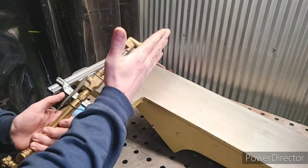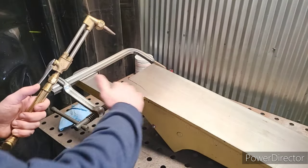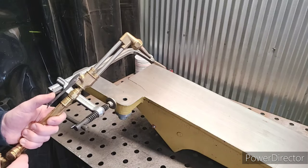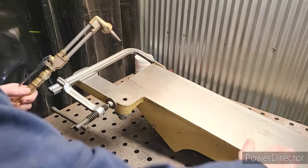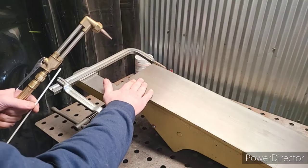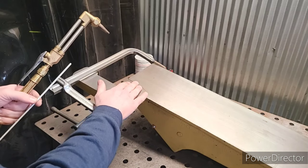For preheating this, I'm going to opt to use the cutting torch head. We don't really need to use the welding torch head — it's a little bit too small for this big part. The settings I'm going to have on my torch are about 6 psi for the acetylene and about 20 psi for the oxygen. I'm going to go ahead and preheat this entire part. Once this entire part is warm to the point where I can just keep my hand on it, then we are going to start heating this area. We don't want to heat this to the point where we are bringing the material to critical temperature, but we do want to get it very warm.